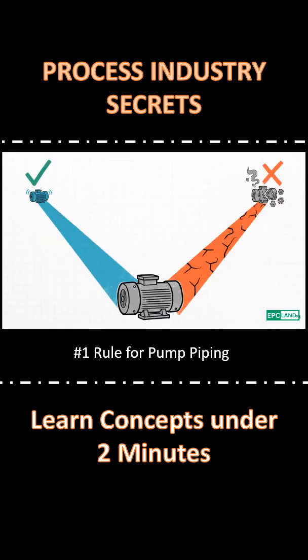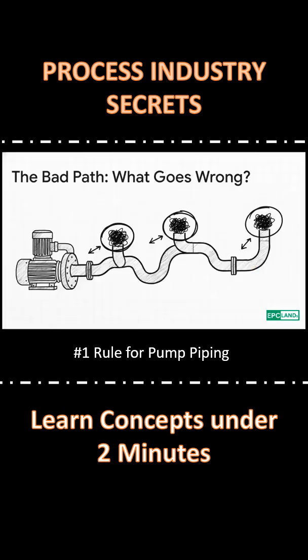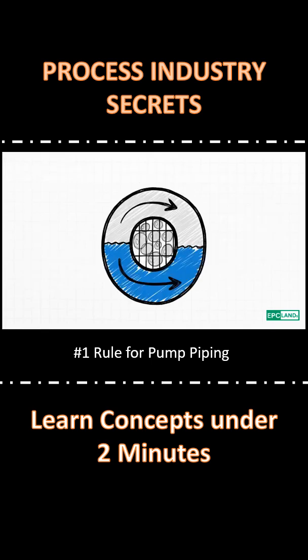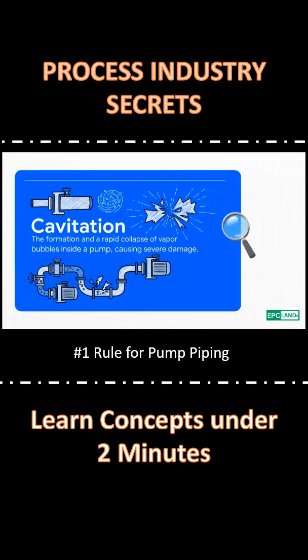Follow this rule and you're on one of two paths — one good, one not so good. Let's talk about the bad path first, the one that leads to a damaged pump. Bad piping is usually long and complicated, with high points that trap vapor pockets. These high points are like traps — gas bubbles just get stuck and can't move. And this leads to the pump's biggest enemy, a really destructive force born from those bubbles. The villain's name is cavitation — it's a total pump killer.